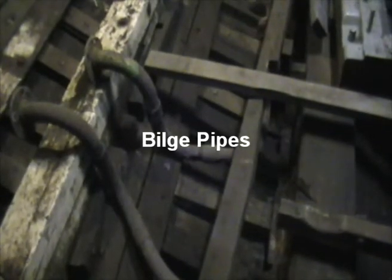What you can see here at the moment is what is left of the bilge piping. Because this was a work boat it wasn't done with copper or brass fittings — it was all done with steel — so a lot of it had rusted out. By the time I came on board, a lot of this area was just a pile of rust and could not be preserved. So if we are going to recreate this, we have to do it in plastic. The stanchions in front of you were also starting to rust out badly, and this whole area could have collapsed if we weren't careful.